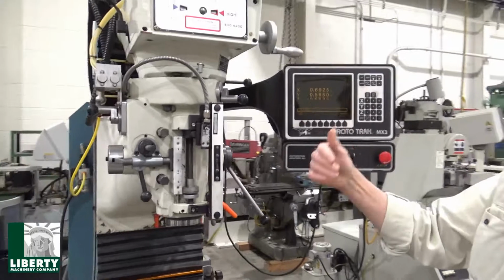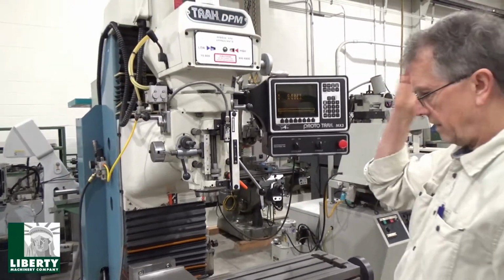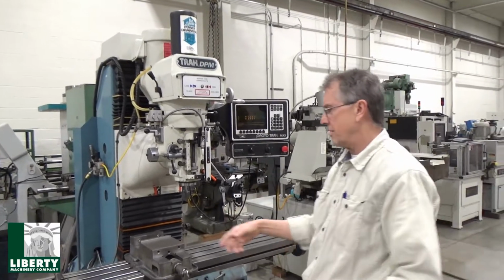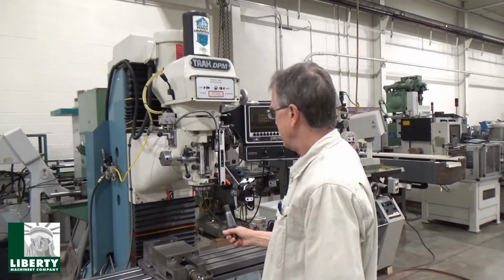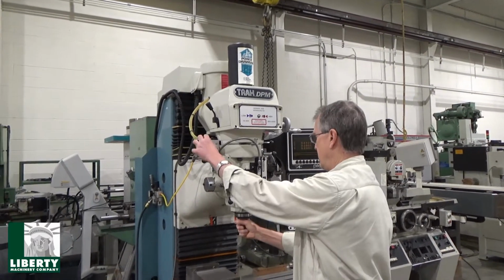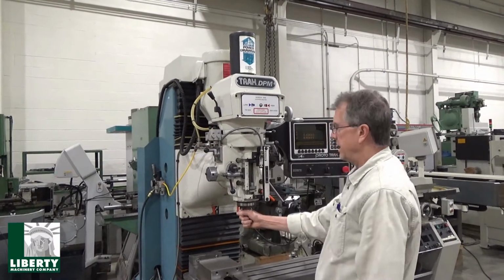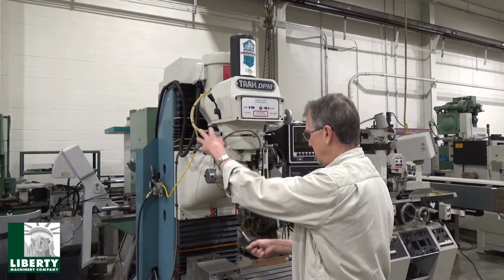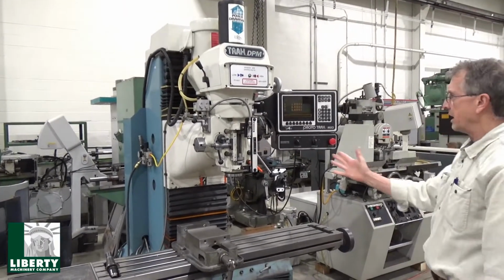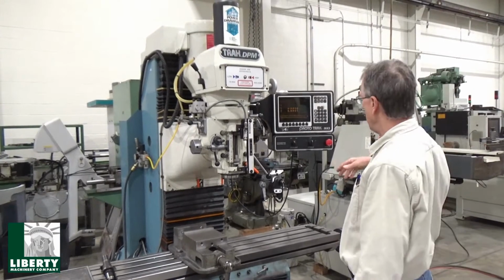And we'll run the motor first. And after the motor, we can shut that off, going high and low speed on here. Oh, let's do the power drawbar. I always forget this. We can do this right away. Go in and out. It all works. And that said, we can jog around. Well, this way, first let's run the motor.